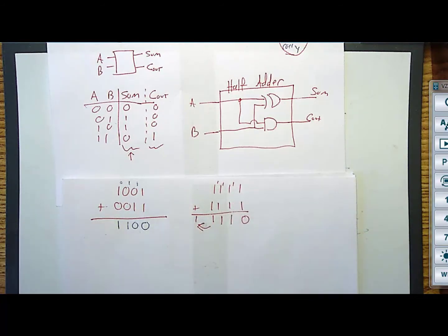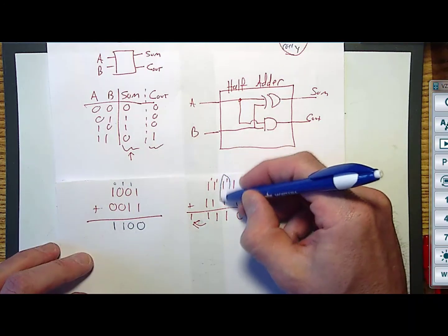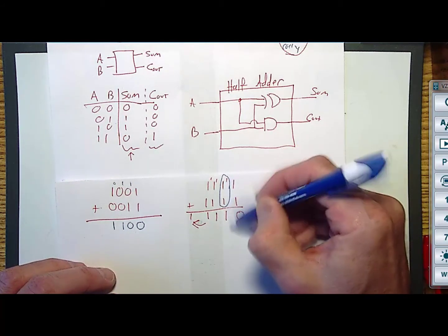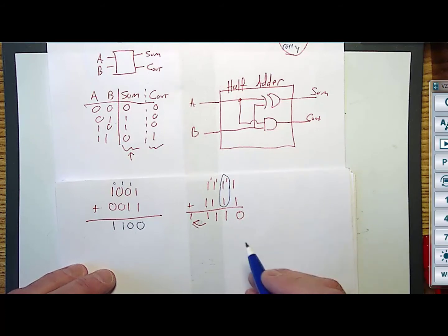So this is crazy because two things emerged from this little exercise. The first thing is that if we're going to build a circuit to perform multiple bit addition, how many inputs does it need to have? It needs to have 3. It needs to account for A and B, which in this situation would be the bits in that position of the inputs, and a carry in that comes from the lower position sum.